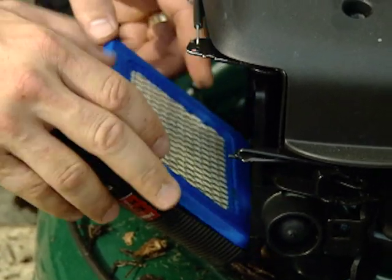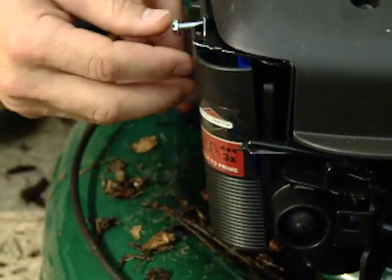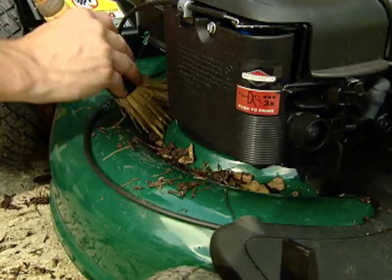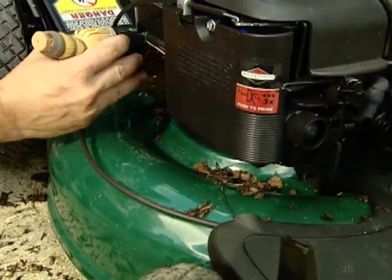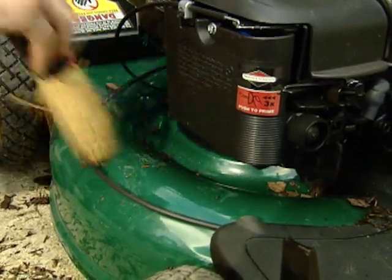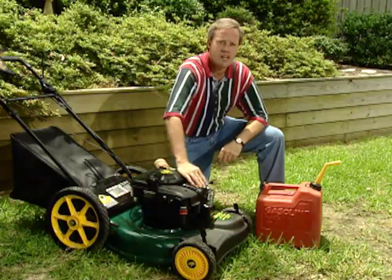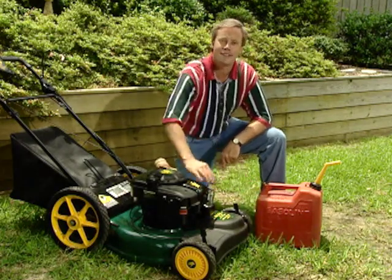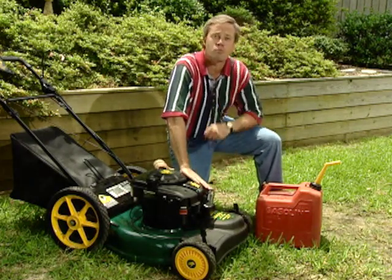You can also lower the harmful emissions from a power tool by maintaining the engine properly. Also, on your lawnmower, keep your blade sharp and the decks of the lawnmower clean. This really helps your engine to run more efficiently and emit fewer pollutants. Another tip, only fill your gas tank two-thirds of the way full. This will allow some room for expansion and help prevent spillage.